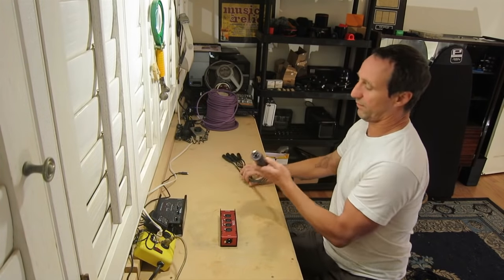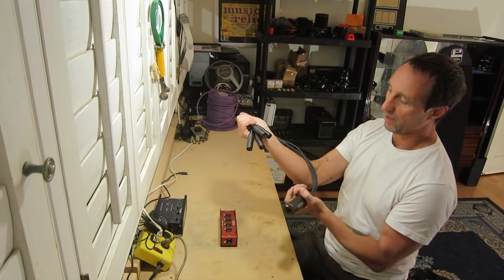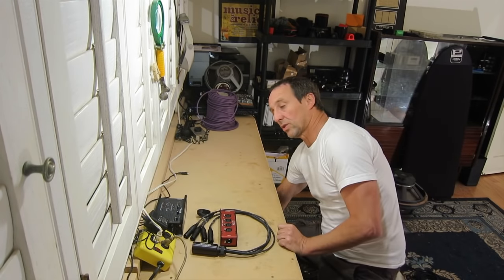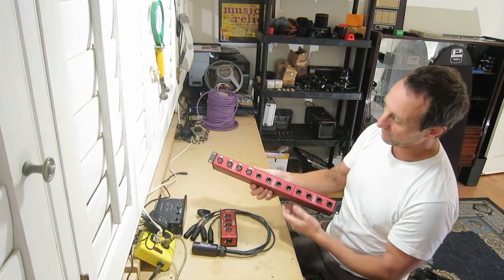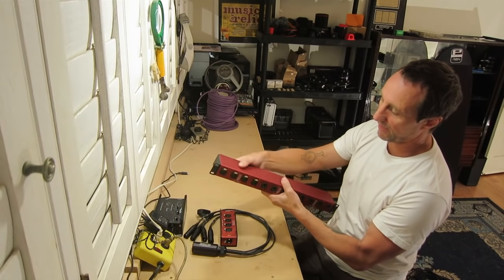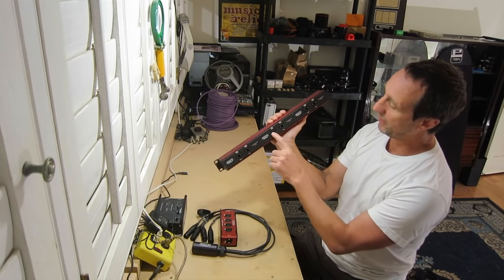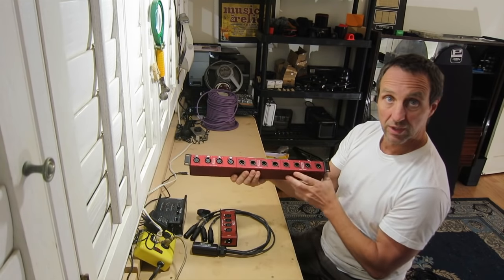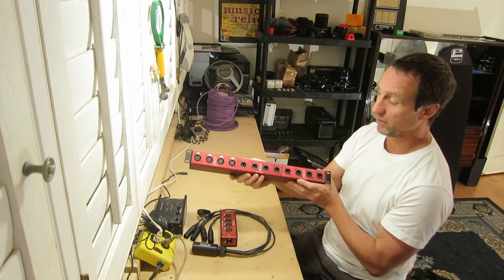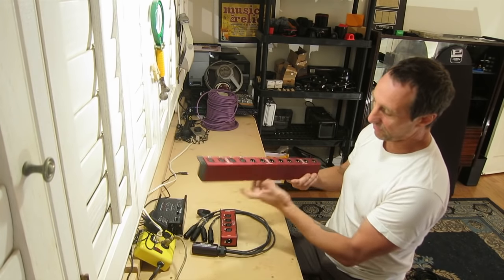This is the Cat Tails, Ethercon in, and four channels of balanced XLR audio. There's a rack mount version as well, a slightly different version. It's three of those bridged together. They mount together, they come apart and turn into boxes as well. The rack ears are removable. Ethercon in and out on each of the boxes. So this is 12 channels of audio down three Cat5 or Cat6 shielded cables. Or they can be bridged together, and you can have four, and you can have ins and outs, and just real simple to use.